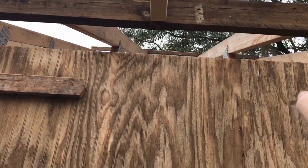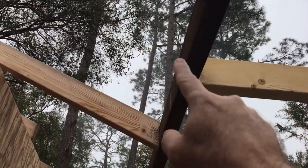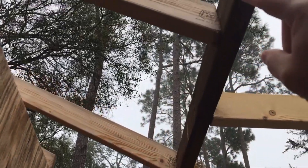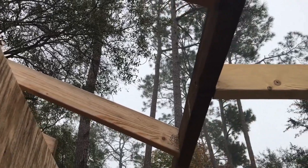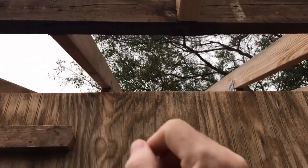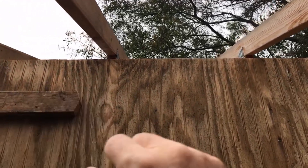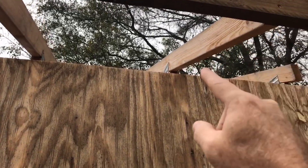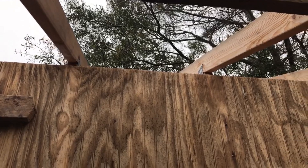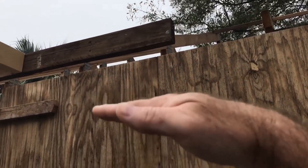This two by four then has to be doubled up on the back side, so you'll have two two by fours there. Those will be fastened in on either end — just screwed in, they don't have to be lagged. But because of the load transfer onto the tails of these trusses, this truss is going to want to do this on each end. So we have to beef this up — on either side of these trusses we're going to have to sandwich them with two by sixes and run it up to the peak so that this part doesn't sag.